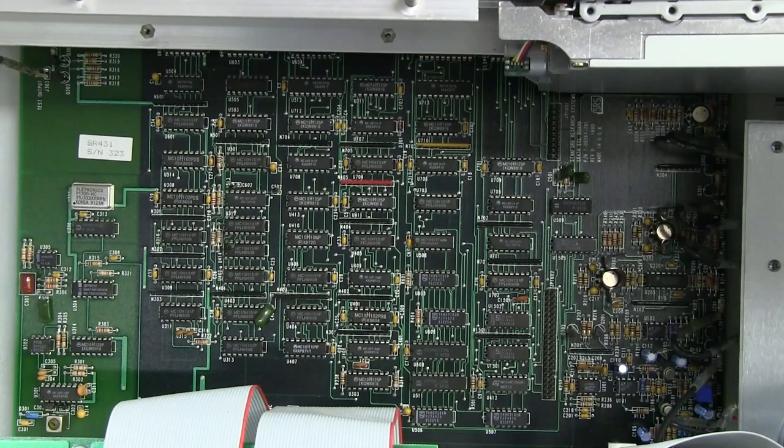All the rest of the circuitry is the bin clock, pulse sorter circuitry, and shifters to capture the serial data input and basically feed it into 8-bit parallel data, which is then fed out via the control connector into our main TTL logic board, which is then stored in our fast frame buffers. I would love to have the schematic for this thing. That 74HC294 programmable divider can divide anywhere from 2 right up to 2 to the power of 15 — that forms the heart of our bin counter. There's other circuitry around there which splits it up into 4 separate phased clocks — a quadrature clock. Those 4 clocks would be used to form the bin counter: different phases for different operations — one would reset, the next phase would latch it, the next one would count it, and the next one would store it. I'd kill to have a system block diagram of this thing.